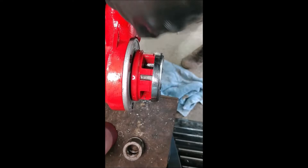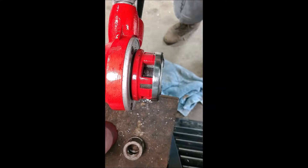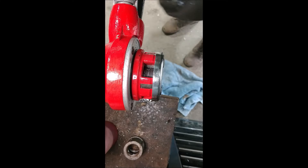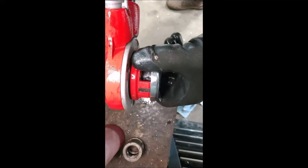Right there I can feel it kind of stop, so I feed it back a little bit until I get to that point where it breaks the shavings off, then continue forward. It takes a little more time doing it this way, but I'm not using these pipes for furniture — this is gas line, and I want to make sure I have a good clean connection. It's important that we're not going to have any problems with leaks. Just from my own personal experience, jammed-up threads can make fitting work more difficult.